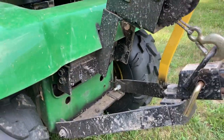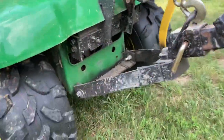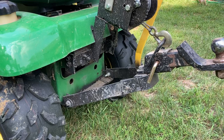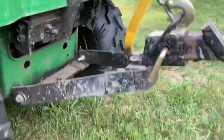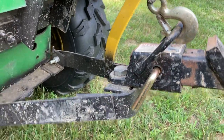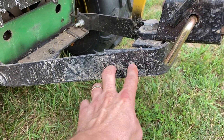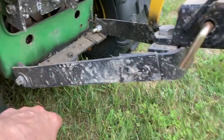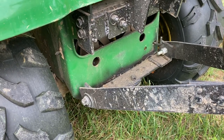They were about two feet of concrete around them, top to bottom. So it's been very, very helpful — very stout. They're not that expensive. I think the Craftsman one you can get for $200. Altogether I might have $60 or $70 in this, but I was able to custom make it for my application. The reason I have it welded here — you can actually see this is twisted a little bit from me having a ton of weight on it. I'm kind of making a breaking point on purpose. On both sides I've got these bolts, and I've designed them to be like shear bolts. I would rather a bolt break than have it tear something up, although this frame is extremely robust — it's going to take a lot to mess it up.